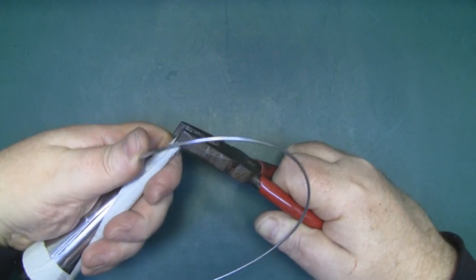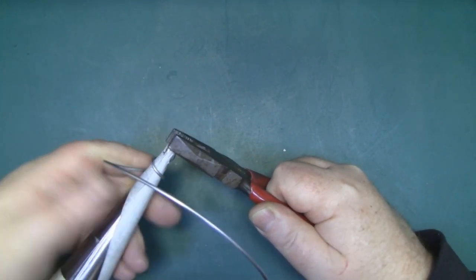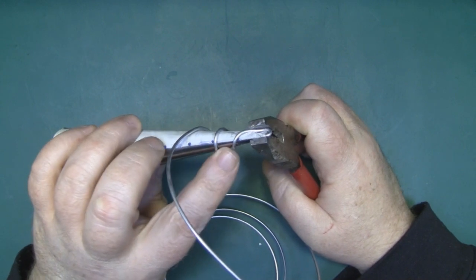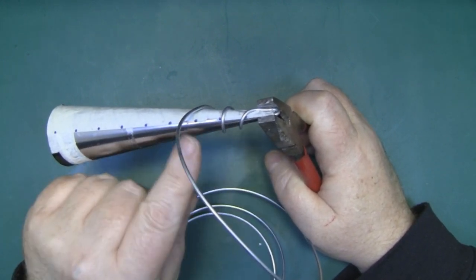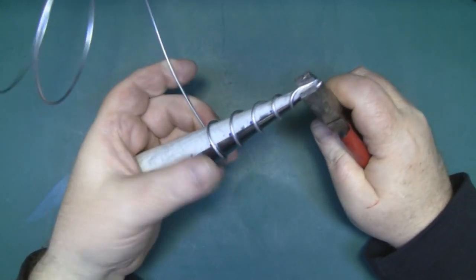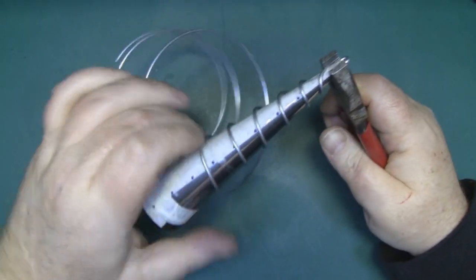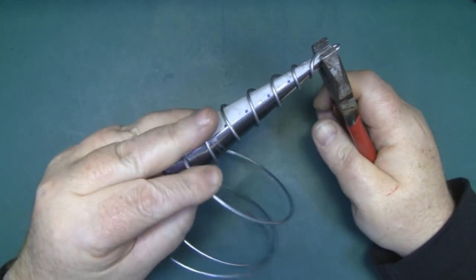This wire is already bent in this direction so I'm going to do a right hand circular polarized cone for this one. If you wanted a left hand one, you can straighten the wire and bend it the other way. So I've got my pliers gripping it at the top so it can't spin around, and now I'm going to start slowly bending it around the cone itself, taking my time to get nice tight coils.